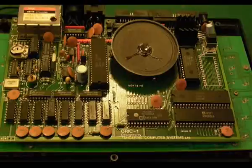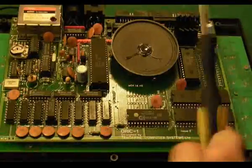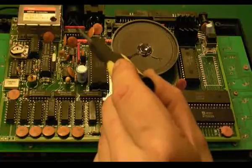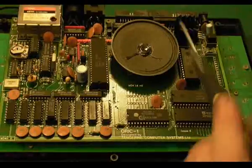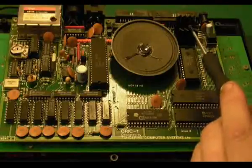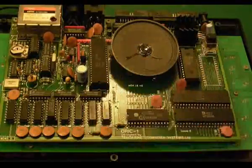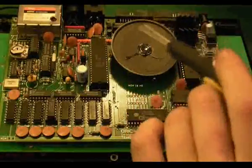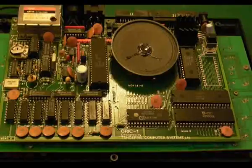Since I got this computer, I've always noticed that the heatsink for the voltage regulator has got very hot. When I pulled the old one out — I didn't have a replacement so I couldn't go any further — I noticed the heatsink wasn't getting anywhere near as hot, though it was still warm; it's only a tiny heatsink, but significantly cooler. That's the offending item there. A new one has arrived, I installed it, and we got video back. It seemed to be working alright.